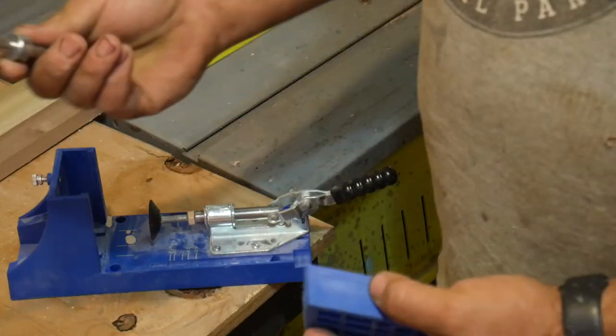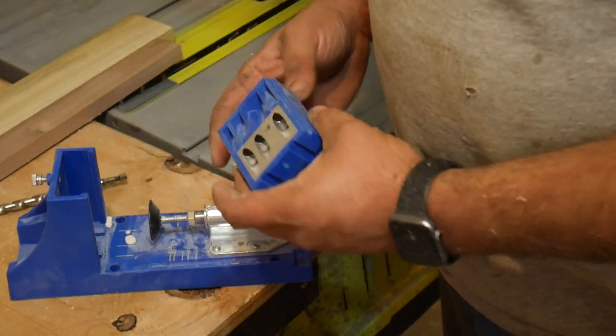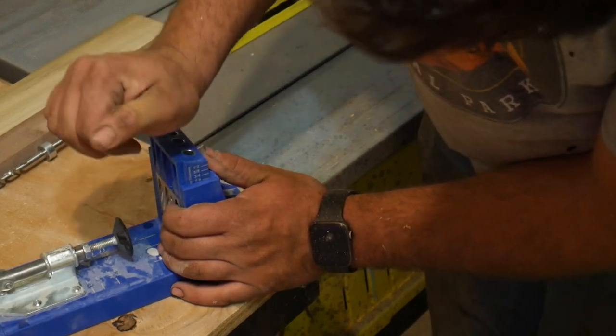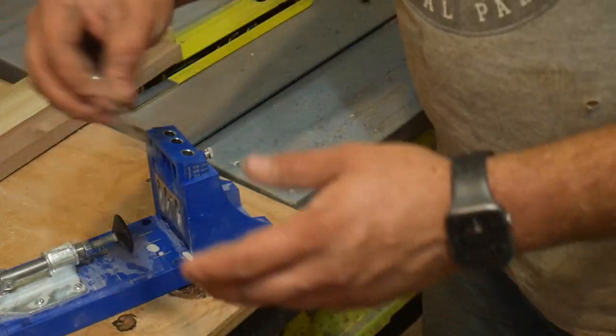So I'm going to be assembling these with pocket hole screws and glue — I think that's the hardiest way to do it. I know there are other ways that are neater where you can't see the screws and the holes, but I think this is the hardiest way, and in a motorhome that's what you need. I'm going to be using a Kreg jig — this is a kit I bought, the K4 system or something like that. It's got a drill bit that drills a pilot hole and the pocket hole all together through this jig. You simply drop it in, line it up to whatever thickness material you're cutting — we're cutting ¾. You screw in a little hold-down, then use this adjustable collar to set the depth of whatever you're drilling.